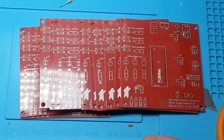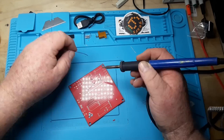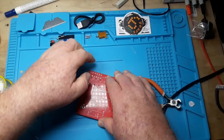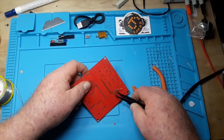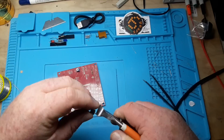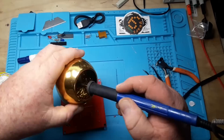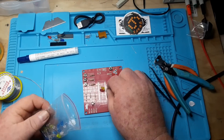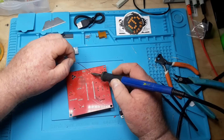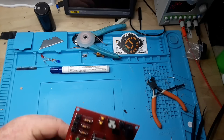Here's a super high speed soldering montage for you. Generally, like always, I just start with the small components — the lowest on the board, the resistors. Use some flux, get them all down. Then I move up to things that are a little bit taller, maybe capacitors or diodes. Finally, we add in the headers, which are the tallest things, and the 7805 voltage regulator. It's just a matter of trying to get everything in there nice and tight, as level and perpendicular and straight as you possibly can. I can't do it perfect, I don't try to do it perfect — I just try and get it as close as I can. That's all you can really ask of anybody.